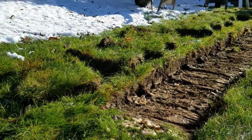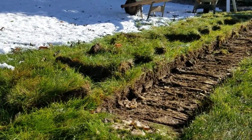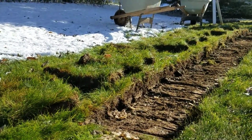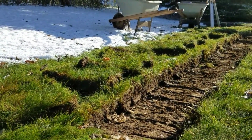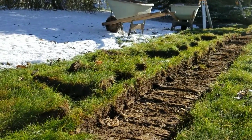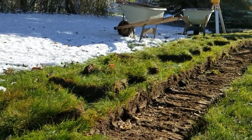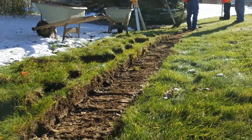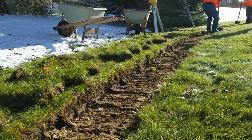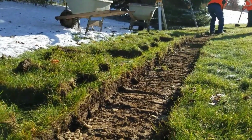They do have sprinklers, so even in the drought, they'll be able to keep this alive over the French drain system. I've had people in the past ask this question: how do your drains fare during the drought season? Yes, you do have to water where the French drain is. If you don't have sprinklers, in Michigan, July and August is our drought season. That's when you'd have to apply some water. That's the prescription. Add water, keep the sod alive, keep the sod healthy and happy.